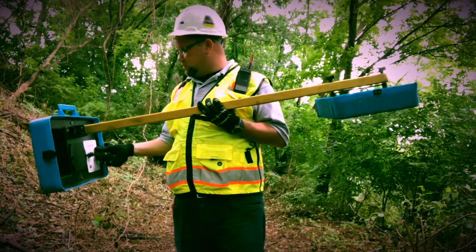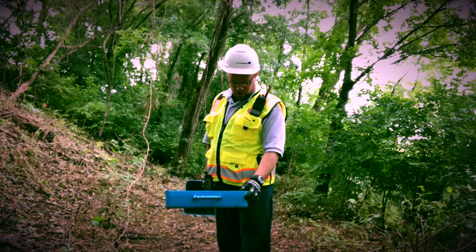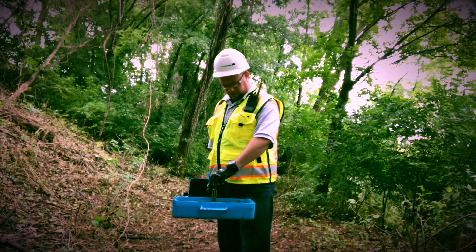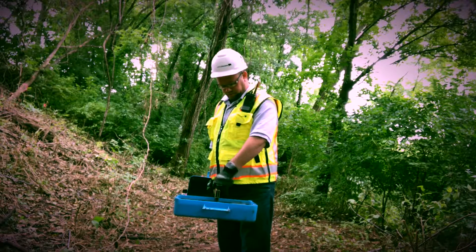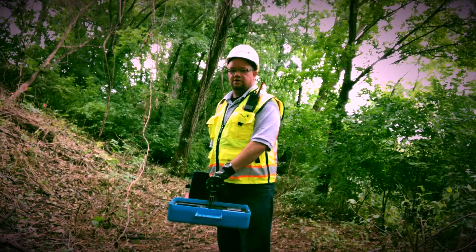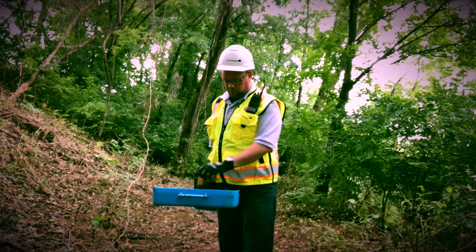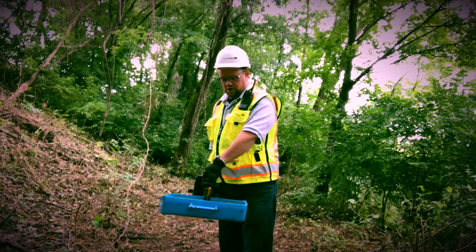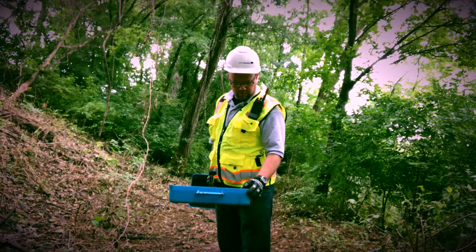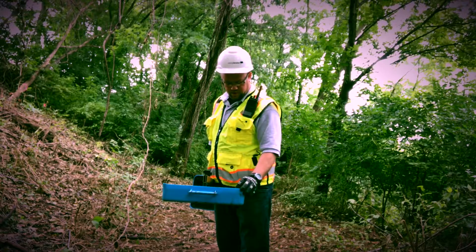I'm going to show you how this thing works. What we've got to do is boot this up and tune it first, so we'll turn it on until she's screaming, and I have a fine-tuning knob here that I'll adjust. Once we hear that quiet — that null in the middle of the two peaks — that's where we want to be. We only want about a quarter turn or so between those peaks, so we're going to tune this up just a little bit more. There's a hair more.